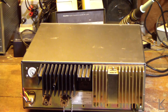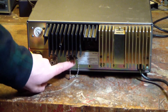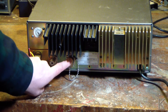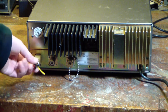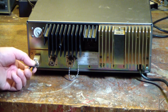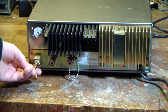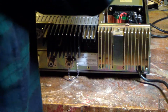The back panel has a transmitter antenna and a receiver antenna — that's probably optional since it likely has a built-in duplexer, but would be used if your duplexer was external. There's also an accessory or control connector, which looks like it was wired into something — it probably provides all the control needed for an external repeater controller, with audio in and out, push to talk, and more.